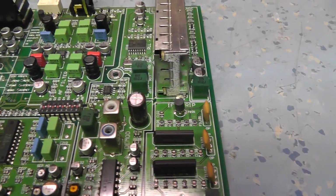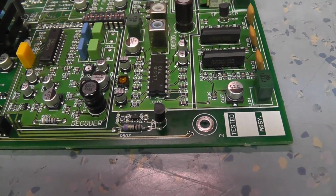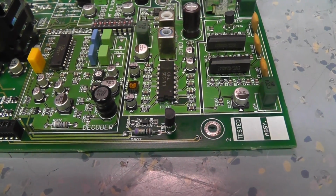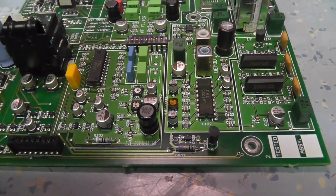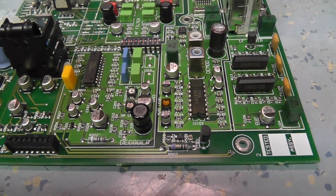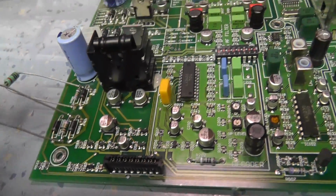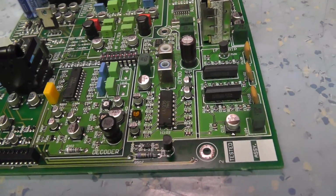So quite a lot of capacitors in here actually. These are obviously used for power supply decoupling. It's always nice, if you can possibly get away with it, to use even a ceramic. I know they're usually lower value, but these surface mount capacitors are notoriously unreliable. These are the type that you find in Samsung TVs and things like that, that fail short or go open.